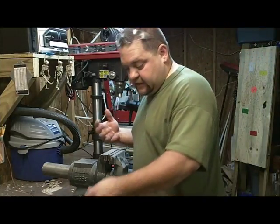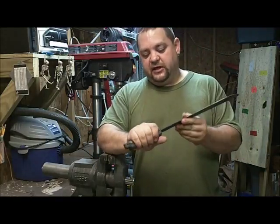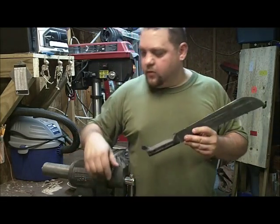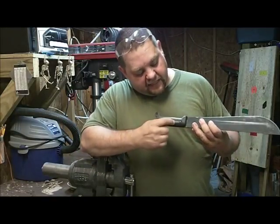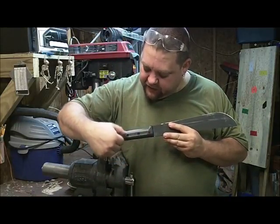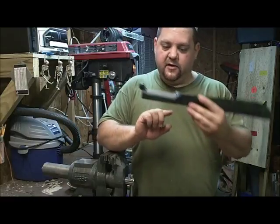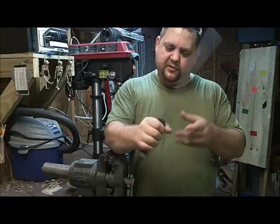Alright, so that's done. I sanded it down, and it fits really good. I had to take the flapper wheel and come down a little bit more. It didn't feel exactly right, so I looked at the other one, and I noticed that I had come down basically to the top line of where the rivets are, holding the sides onto the blade. So I did that, and then on the fingers, I came in just a little bit extra so my finger could wrap around real good.